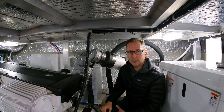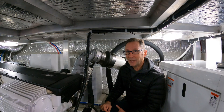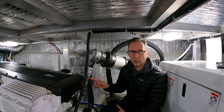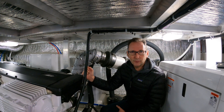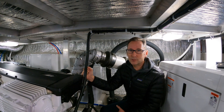One of the things we've also added to these engines is exhaust gas temperature sensors. These may not be as critical, but I love having them — they tell me a lot about the engine. On Volvo, there's a spec of about 640 degrees after the turbo. The sensors I have sit right after the turbo, and I can tell whether the engine has greater load than what it's designed for — due to things like heavy seas, the boat being overpropped, or the boat being overloaded on weight — meaning we're driving premature failure by overloading the engine beyond its spec.